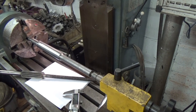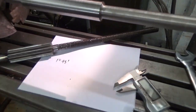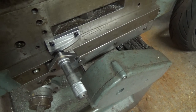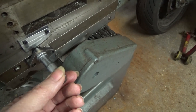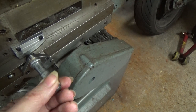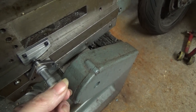To compensate for the hob lead angle, on this machine I can swing the table to the correct angle. This hob needs a 1.75 degree angle. I've made this micrometer adjustment to make adjusting the small angles easy. All I need to do is dial in 1.75mm, and due to the magic of geometry and that funny shaped cam, I should get pretty much exactly 1.75 degrees.